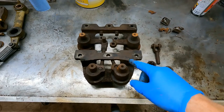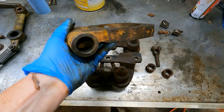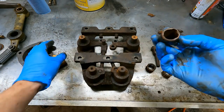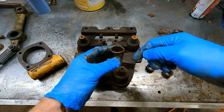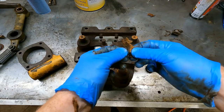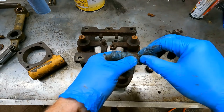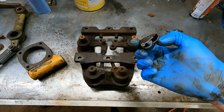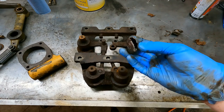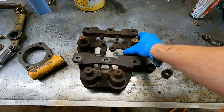Back here at the bench. In the last video I was talking about this fiber line bushing I had in here - this was off the main clutch. I actually got both the bushings pressed out. They are steel cased, and then inside was this material which looks like some kind of hemp or rope or something - some kind of lining. Both of them had that, so it must have been some kind of repair aftermarket bushing, because I don't think there was originally a steel bushing in here. It was a pain getting those out - they did not want to come out.